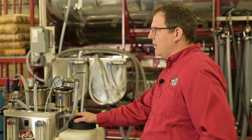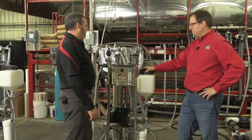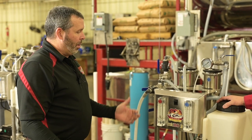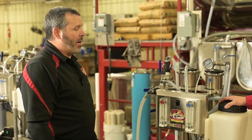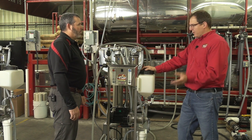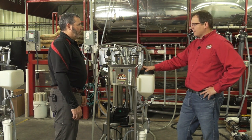For the permeate rinse, we want to put at least 60 gallons through each membrane. We'll rinse the machine for roughly five minutes — about 120 gallons total on this rinse — and we're going to rinse that machine now to send it to the next stage.